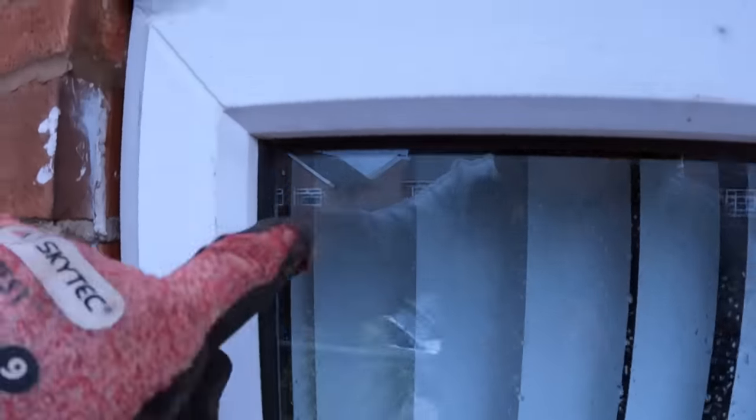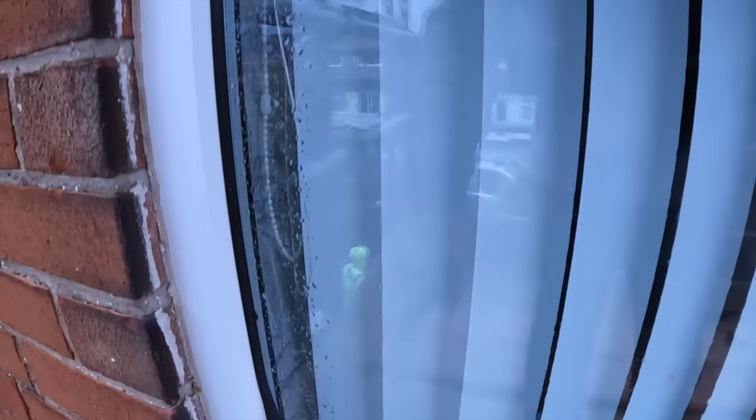You can see how much the brickwork has sagged onto the window. Knackered the window up. See, it's almost touching at that end. And then these gaskets have had it. We need to speak to the customer about these, tell them they could do with new windows, really. They're all knackered, all the gaskets have shrunk and come out. So in a bad spot there as well at the bottom of the window, because water can get in there, look at that.